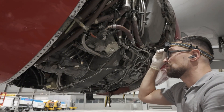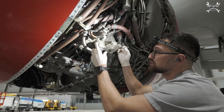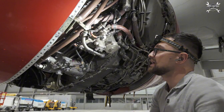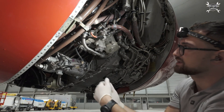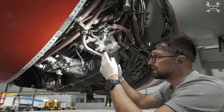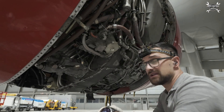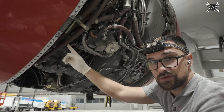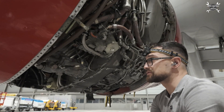The oil filter is found on the lubrication unit. We actually have two filters: a backup filter which is a small one, and the main filter which I have here. There is also a magnet chip detector which collects all magnetic particles from the engine, and four screens. If you want to know what those screens are for, I have a video linked in the corner or in the description below.